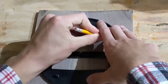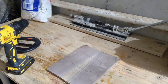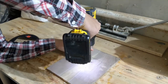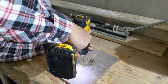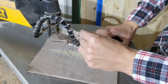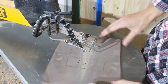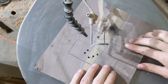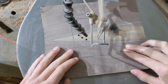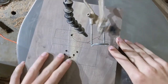I then took the old clock face and traced out an outline of what I would need to cut out on the new one. From there, I could begin drilling — just kidding, these are starter holes for the scroll saw. One of the most unique things about having a scroll saw is it gives you the ability to cut out pieces in the center without having to cut your way in from the side. If you drill a hole in the center of the piece, you can insert the blade into it and begin cutting from that point, rather than cutting from the edge, which is what you would have to do with a bandsaw.